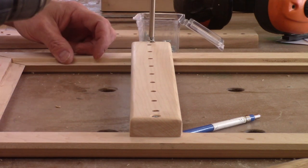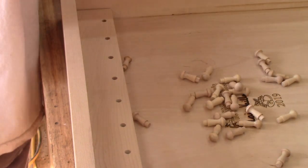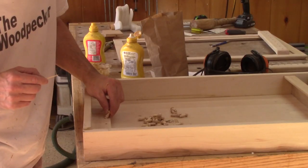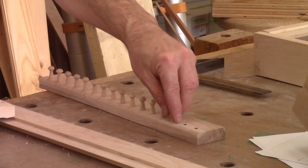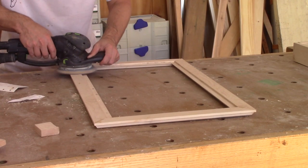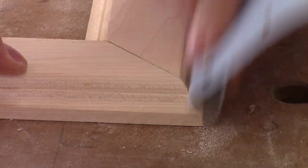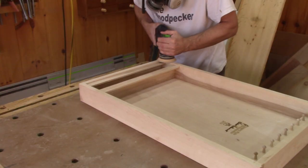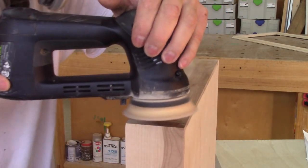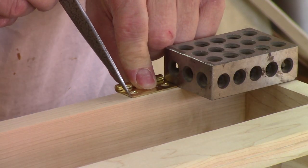It's now time to glue all the small dowel pieces that will hold the necklaces in place. I don't put a lot of glue because I don't want it everywhere, but I still have a lot to glue. This takes some time, but I manage. Now I need to finish the door — the first thing I do is sand everything up to 120 grit. I also sand the exterior of the case again up to 120. Now I can mark and cut the mortises for the hinges.